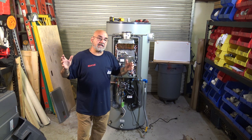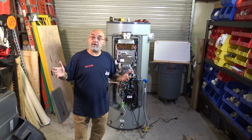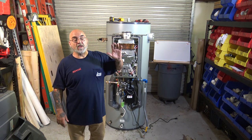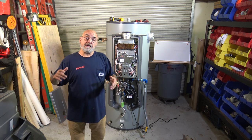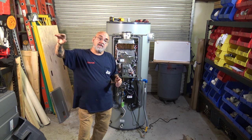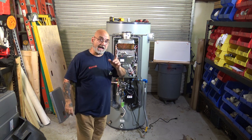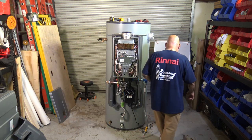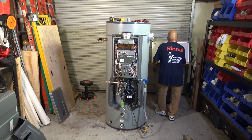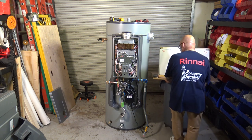But if you take a number 60 or a bronze 007, that's producing 5-6 gallons per minute. So with that, what you're going to have to do is either double up on the pump, pump it separately into the cold water, and mount aquastats on it. And in a minute, I'm going to go grab an aquastat and I'll show you what I'm talking about. So let's get the dry erase board over here and go over some of the piping.